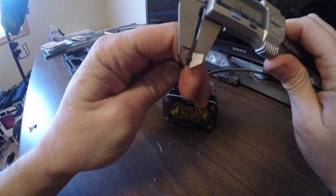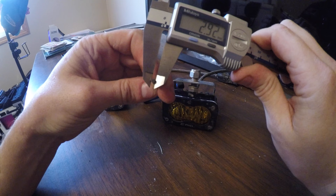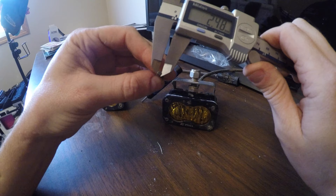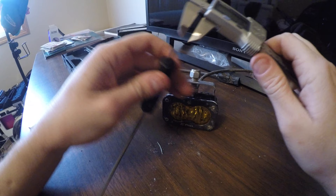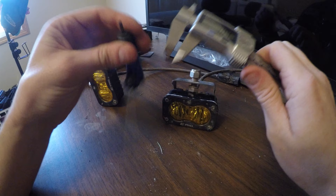That's what those things are measuring. This is my Allen wrench I was using. This thing is probably close. It's an old cheap one. That's right on — 2.5. Let's see what the other side is here. 2.46. Let's see what the other end is — I was using this end as well. 2.49.